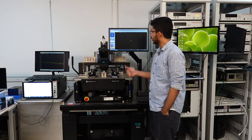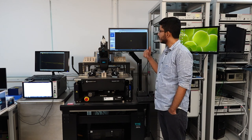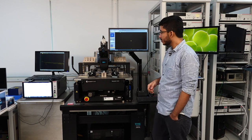The software used for RF characterization includes: Clarius, which is present in the 4200; WinCal on a separate PC; the Control Center and Spectrum Vision software from the Velox PC; and the inbuilt S-parameter analyzer present in the VNA. The steps to start the system have already been discussed previously in the semi-automatic probe station video, so we will start off with loading the die as the first step.